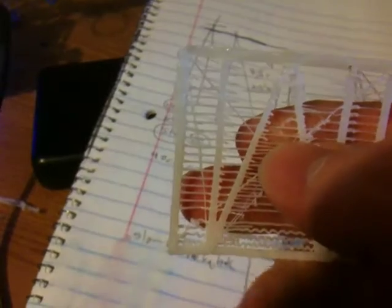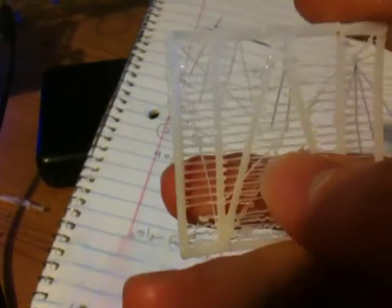So on this I would say, okay, this through there is good, and where the bridges are no longer connecting up at the top, that would be an indication that it's not extruding enough for that thickness. So what you're looking for is inside this triangle, you're looking for the bridges that are still there. So up to this one is fine. Then you go down, and then the warped bridges are not fine.